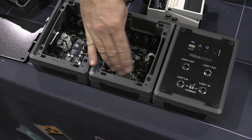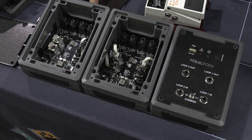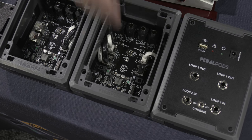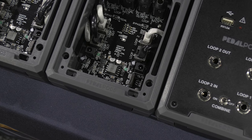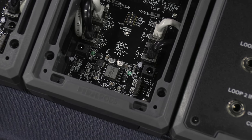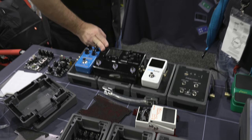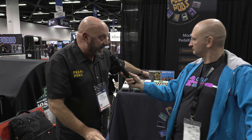The lower half of this has two power ports. This is a DC-to-DC isolated, regulated, switching power supply. It uses true galvanic isolation and you have the ability to select 9, 12, 15, or 18 volts. It can provide up to 650 milliamps of current at 9 volts. We have an HX Stomp that we're powering with the system — no problem. Behind us, we have two carbon tube pedals that draw one amp continuous each, and then the Mach 100 that draws five amps at 24 volts.